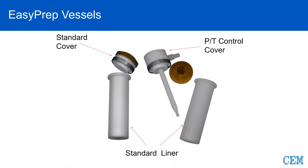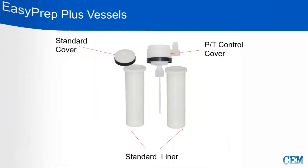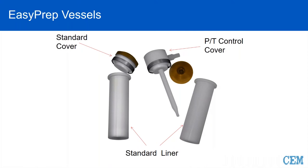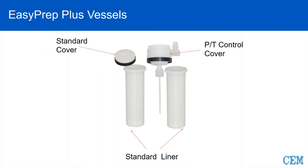There's your molded Teflon for EasyPrep. Notice the material is silver for the ring — that is our titanium. The EasyPrep Plus ring is a stainless steel with a composite coating, which is fantastic for nitric applications and HF applications. Over time, HCl may start to attack this type of material when venting, which is why we also have the titanium available.